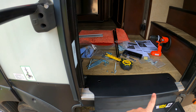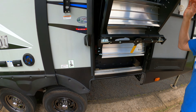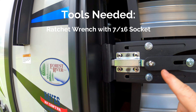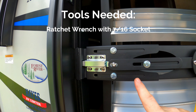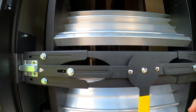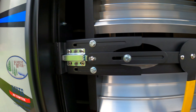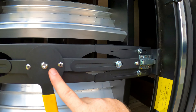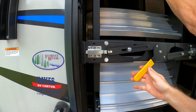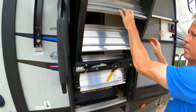Now that we have our pilot holes drilled, we are ready to install our latch. We've actually already adjusted these. You'll see how this latches in right here — it's a very simple process. You have three 7/16ths nuts right here, and that's how you adjust it out. You slide these out and make sure that this surface comes into contact with your door frame on either side. Snug it up — make sure nothing is dragging on the door frame. The operation seems to be working pretty good.